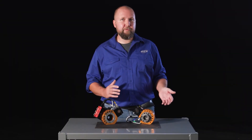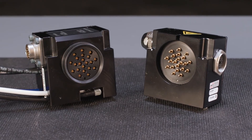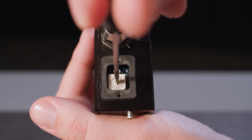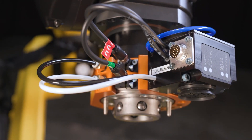Let's look at some of the other unique and helpful features of the CV14. The CV14 control module incorporates IO to allow communication between the robot and the end of arm tools, tool ID to verify that the correct tool has been picked, and lock and unlock sensor cables to confirm lock status of the tool changer.